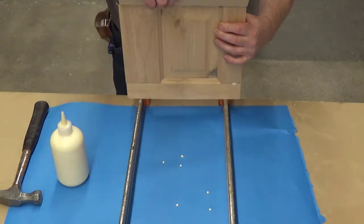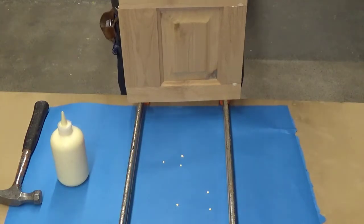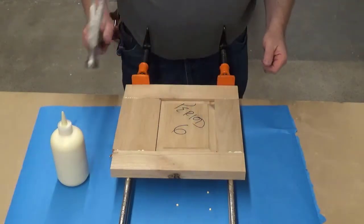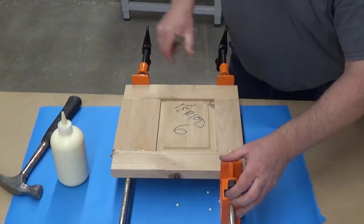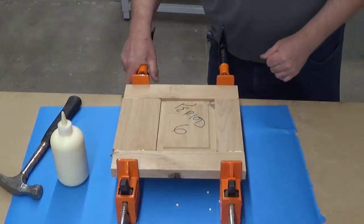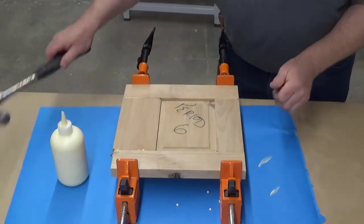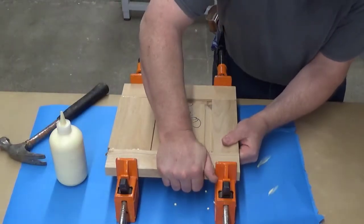Take your stile and put it up top. Just a reminder — make sure that your back side is face up. This is where we're going to do all of the pounding. You don't want to tap on the faces and create dings. I'm going to be using the hammer on this. The camera is on the workbench so there will be a little bit of vibration as I'm pounding — that's not anything weird with the camera. I'm going to use my hammer to tap these in and make them even.